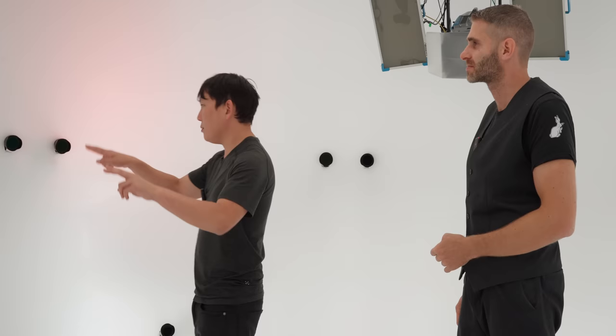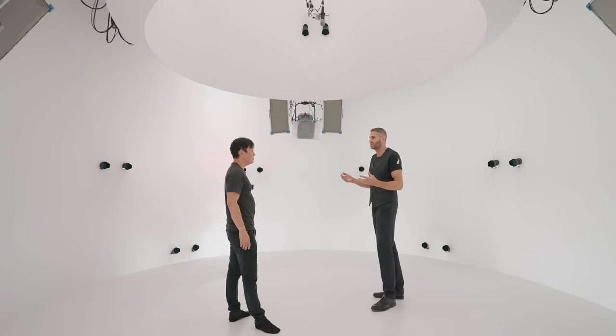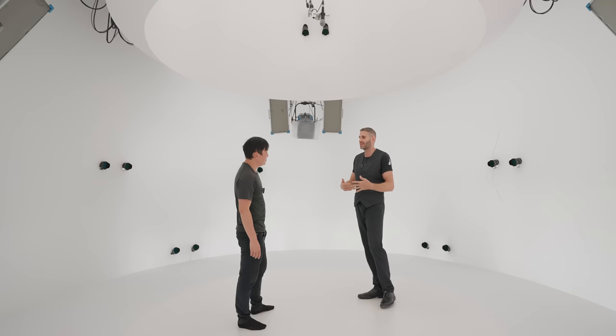I see that all the cameras are placed throughout the room in pairs, so you can get a stereoscopic image from each set — that's better than having them evenly distributed. It's easier for measuring depth. You might know photogrammetry where you have like 200 images of an object, but the problem is you need a lot more cameras. With stereo pairs we managed to use very few cameras but still have very high quality depth reconstruction — clever when every camera is expensive and adds more data.